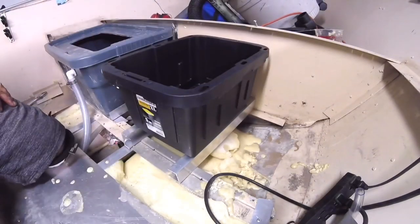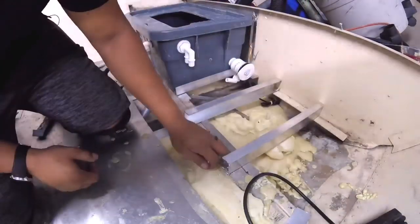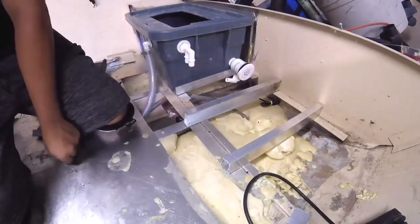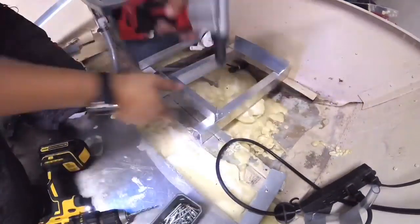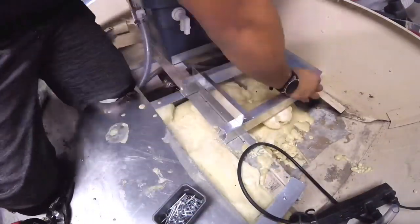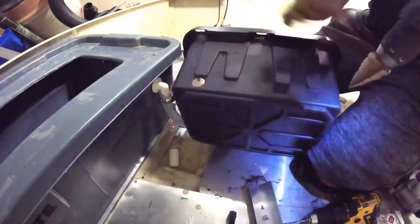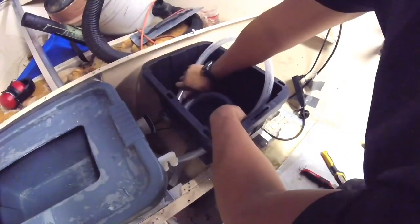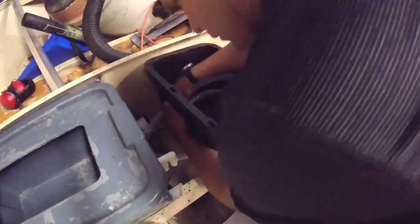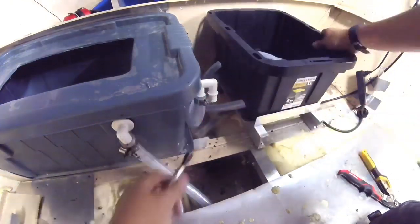For this boat we bring back the famous Chill Mod, and we're using a five-gallon Commander top box. We're making a solid base that it can sit on because we have to run the drain port directly in the base, and for it to free float and be okay it's going to need a strong foundation. I used a step-down bit to fit it perfectly so when you push the hose in it pressure-fits into that hole with a perfect circle — when you go to seal it you won't worry about any water pouring out. Five gallons will be more than enough — it'll probably hold a ten-pound bag of ice, hold enough drinks, and still cool the water down a few degrees so the water holds more oxygen as the live well circulates.